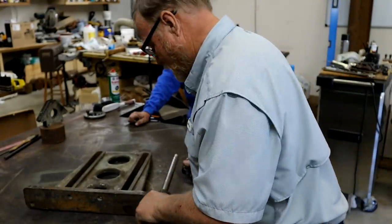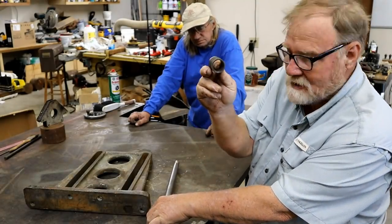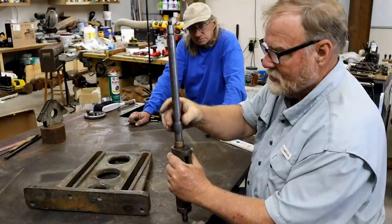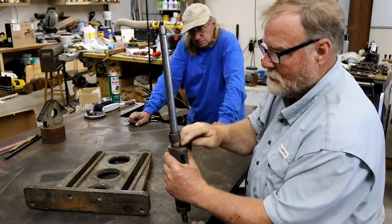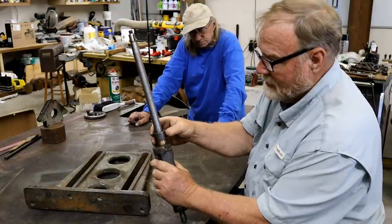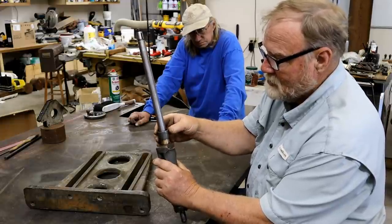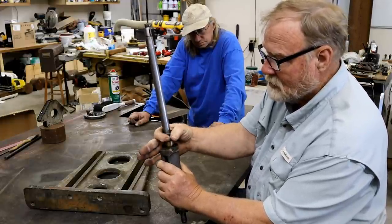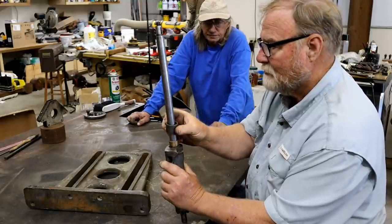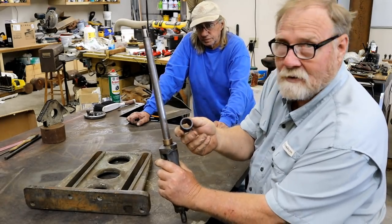So he drove back to his place and he got us this little piece that was stuck inside the bore. So this thing basically has this going over this piece of bronze, or brass, I guess it's bronze. And that's the bearing for it. And then this piece of cast iron locates into the machine, and then they secure it with this. That little eighth inch piece of cast iron is just cracked right off.